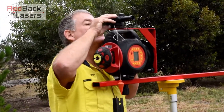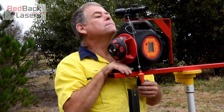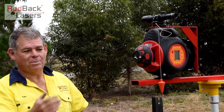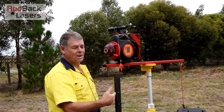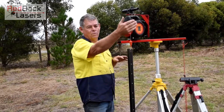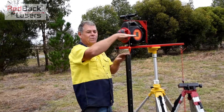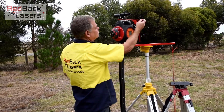Height challenged again. I can see the post there roughly. I'm going to lock that in and then rotate. I've aligned that to the left-hand side, or the front of that post, which is where our fence line is going to be. That could be 500 metres away — it could be up to a kilometre away. But now I can go and work up to 350 metres and put my posts in. What you need to be wary of is if we're working on a rise: as we put our posts in, if we work away from the laser we are going to shadow the laser, so we'd want to work from far and come towards us. Otherwise we can work from here, but understand we're going to pick up high — we can't pick up below our host post height.